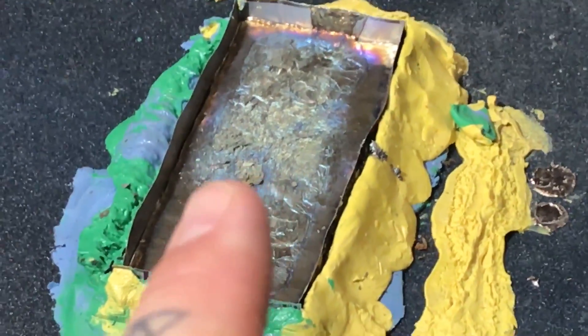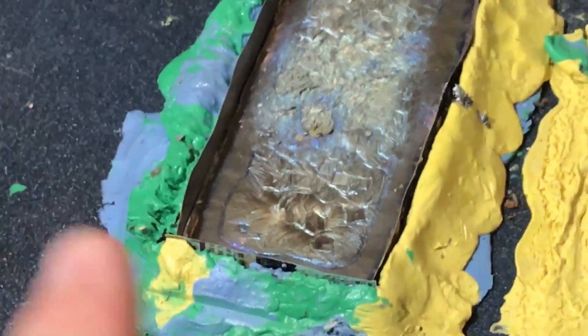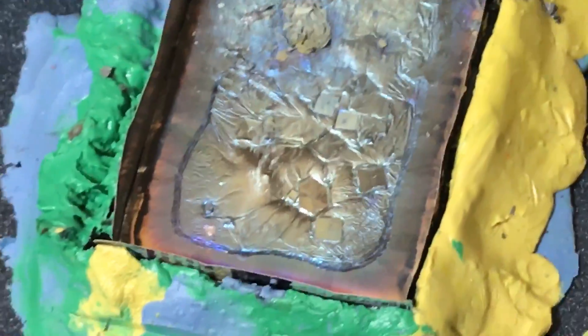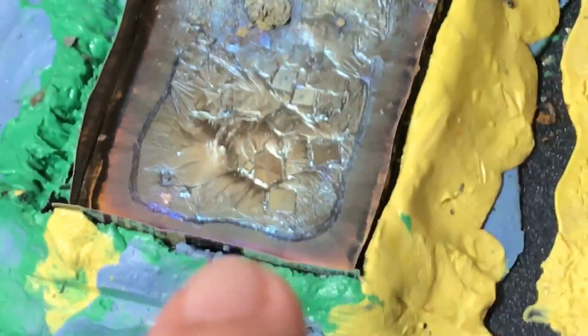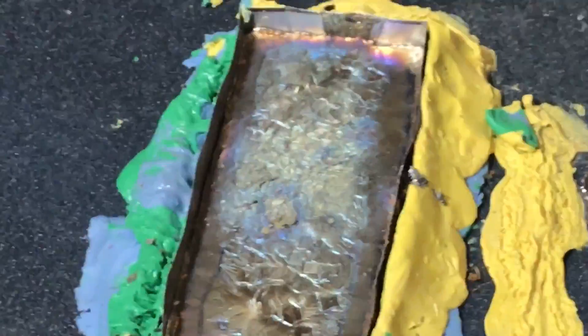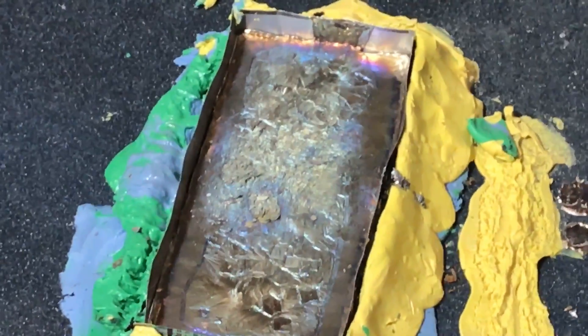All this purple and blue is actual natural bismuth oxidation — this is 100% pure bismuth, and that purple and blue color is all natural. All those little square bits there are bismuth crystals. As it's cooling, it's shrinking inward — the edges are always smooth, and in the center where it cools the slowest is where the bismuth crystals always form. They're formed and sealed on the inside, growing inwards as it cools, just like a loaf of bread.